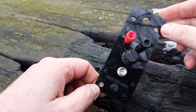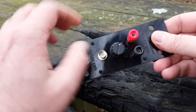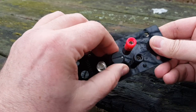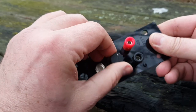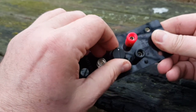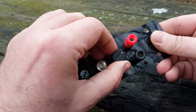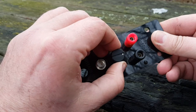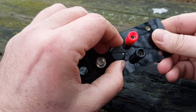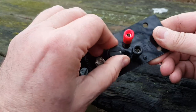The Valley Tuner from Sota Beams is a really good tuner. I like it — it's the only one that does 80 meters, and it's very simple. I would have preferred an LED indicator for SWR, but you can do without it. If you hear the sound increase significantly, you're pretty much assured you have an acceptable SWR — so it works like that.